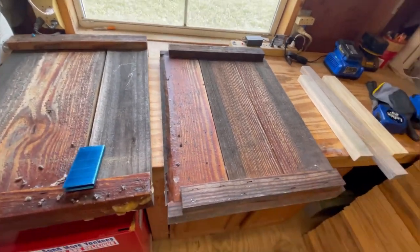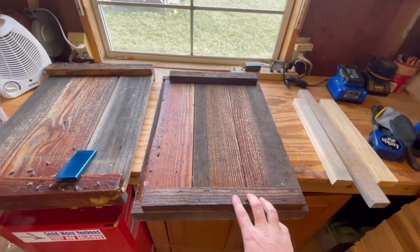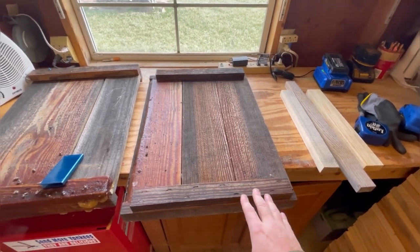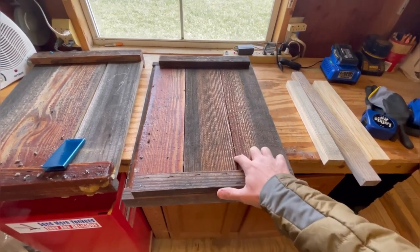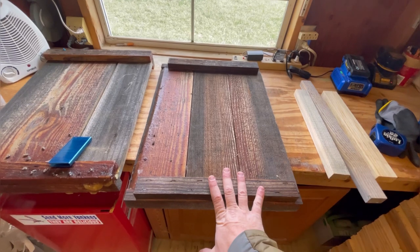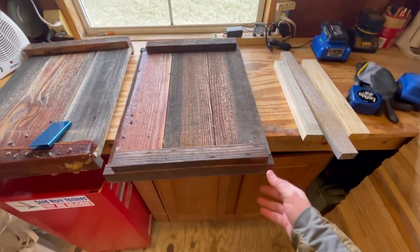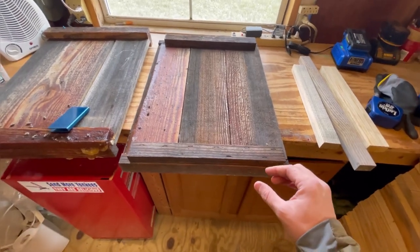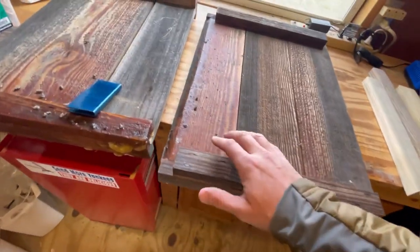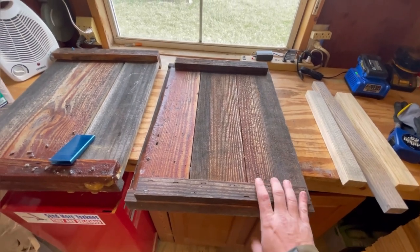The equipment I'm building is to last for 20 years — it's the bare minimums that you need for bees. The bees can propolis and weatherproof this, that's not a big deal, but I want this equipment to last. I'm very rough on my equipment, so I make sure to use every last scrap plus build high quality — stainless steel staples, wax dipping. You can see some of the residue of the wax leaching out of the wood. This lid is going to go easy 20 years.